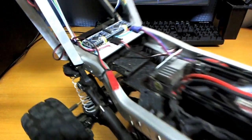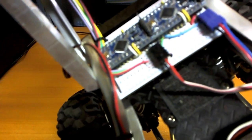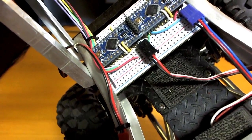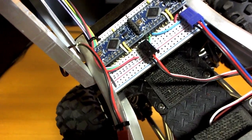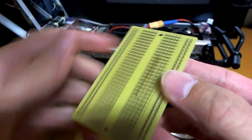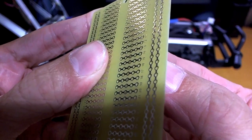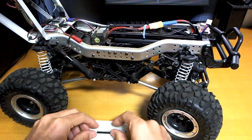The first thing that I did wrong was the way I soldered these Arduinos on here — one of them in particular. They're soldered onto a breadboard-styled PCB prototype board. I soldered the Arduinos on there like this, and the problem was that I thought it would be clever to keep the backside completely flat. So what I did was I put the pin headers in there so that they were just flat — not poking up at all — like if you put it down on the table like that.